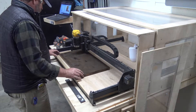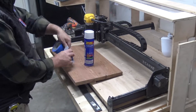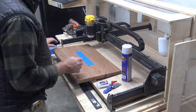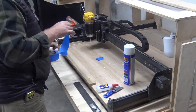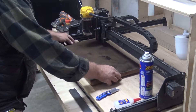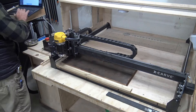I want to give a shout out to one of my subscribers, Conan - thanks man. He actually saw me using double sided tape and thought there's a better way. He sent me a link to this 2P10 super glue with an activator. This is basically going to replace the double sided tape by using glue tape to adhere my carves to my table. Good looking out, Conan - this is working so well. I'll mark the underside of the piece by taking a piece of blue tape and rolling it up so I can see exactly where it's going to line up. Then I'll put the super glue on, spray the activator and adhere it to the table. Next I'll set the Z-probe for depth of the carve and let's get to carving.